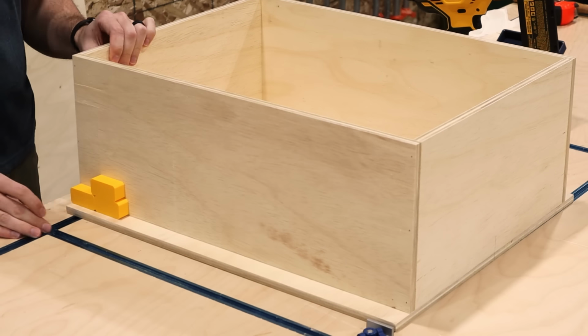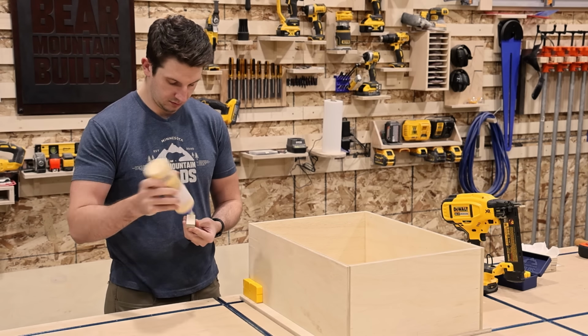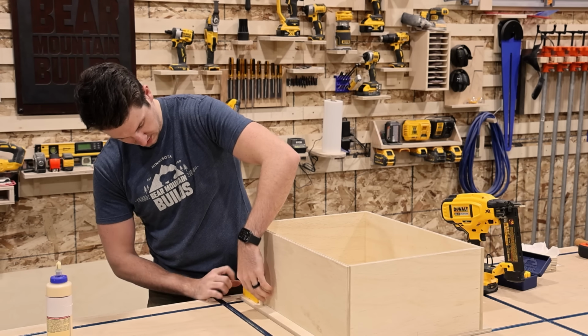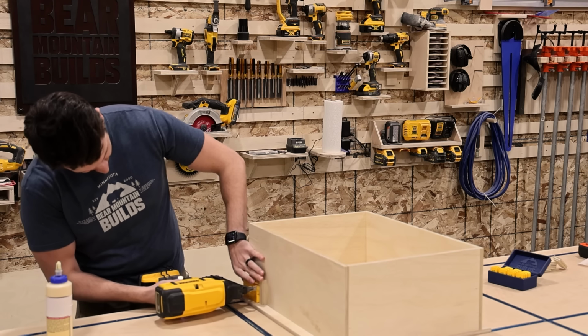Since these bigger drawers are going to be probably taking some more weight than our thin drawers because there's more volume here and we're going to put some heavier items in, we're going to be moving our stoppers forward by another 2 inches. That way we can just prevent any sort of binding that will come with that extra weight.